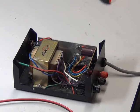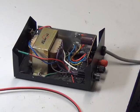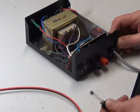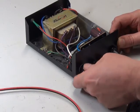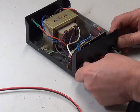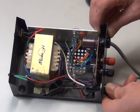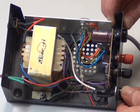Right, now we're back to the finished article Mr. C has been working on. If you'd just like to take the fuse holder out and show the viewers — this is now captive. There we go, so you haven't got the danger of touching the live fuse. It's been rewired so the live goes straight to the fuse, then to the switch, then to the transformer. And we've actually now got shrouding on the mains transformer and on the switches, so they're insulated from prying fingers.